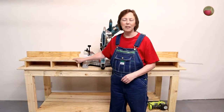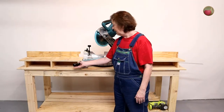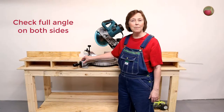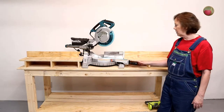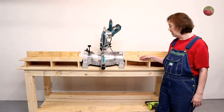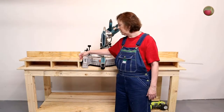As you can see, I already have one finished built and I'll show you the tips and tricks on that. And then over here I have one dry fitted that I can dismantle and show you how I did everything. One of the most important measurements for knowing your length is to check for cross cutting at an angle. Make sure you have room and you're not butting up against this. Don't assume that both sides are the same — most miter saws aren't. This one goes significantly further on this side, so I cut a cross angle on it and had to shorten and angle the support so it wouldn't hit and I'd have room to get my knuckles across to move it.